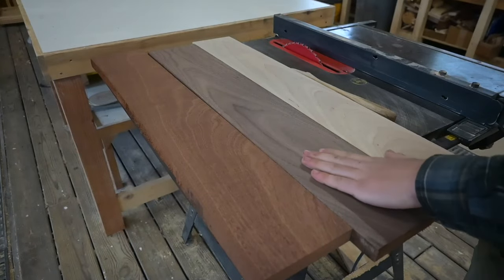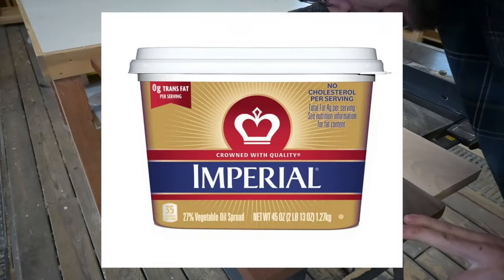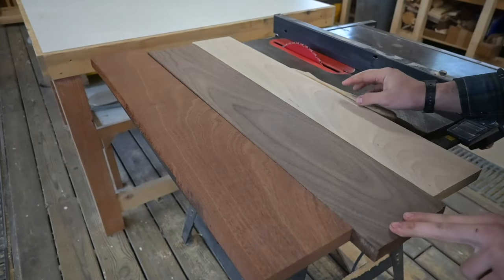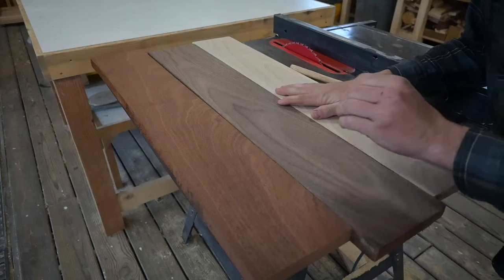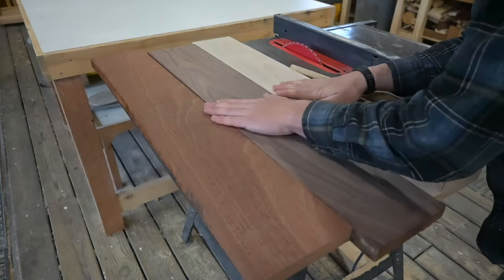That's some pretty wood right there. I mean, that stuff planes like butter. I think it's actually easier to plane hardwoods than softwood, because the softwood just kind of squishes and gets clogged up and makes giant shavings. These are almost like table saw shavings.